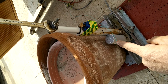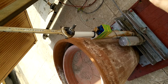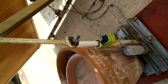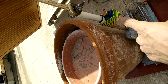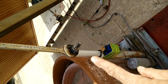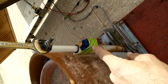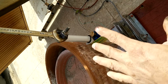Problem, it still takes current, and that's not efficient. Whenever it's all the way up, it should cut the current and stop any activity of trying to go upper or trying to go this way any longer. The same goes to the down way. Whenever this piston goes down, I want it to press by this bolt on this salvage switch, and then it disconnects.